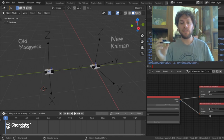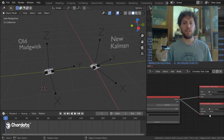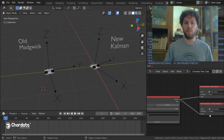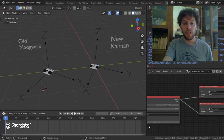While the Kalman one stays stable during the influence of the magnet — it just didn't move. That is because the Kalman filter is aware of the magnetic error it's receiving at a particular point in time, and it's able to compensate it and give much more accurate results during these kinds of disturbances.